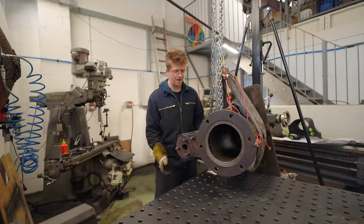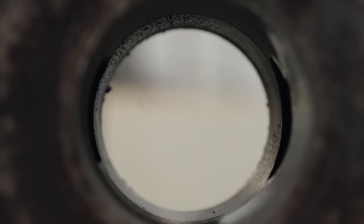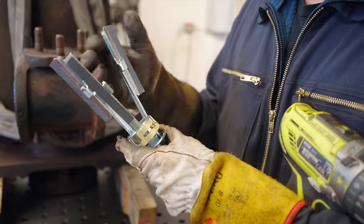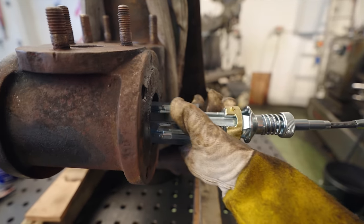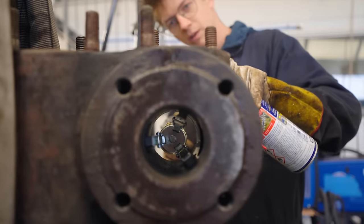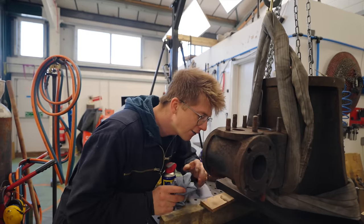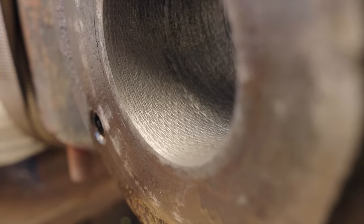Maybe it was a bad idea to try to put it on this table. Have a look at how this thing works — we have stones, and this little brass collar can lock it into a more closed position. I'm pretty sure this just goes in there. Get a good look at the surface finish now — we're going to see if we can clean that up. I'll put some WD-40 in. You know what, I definitely think it's taken off some of the high bits — smoothed off the peaks of the cut. Anywhere where it's really high it's starting to get polished, so maybe it is working.